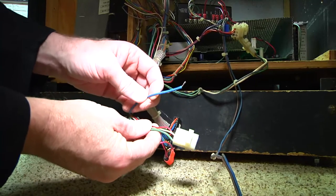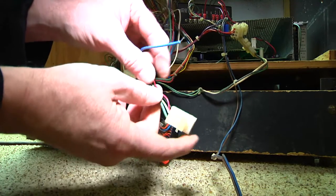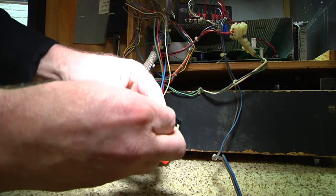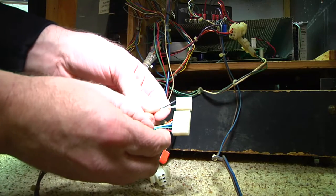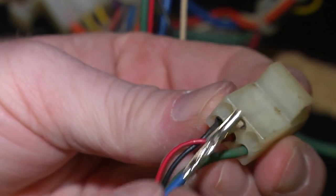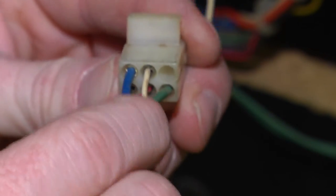As you can see, we got one of the blue wires that sends the signal into the monitor out from the motherboard. One of the female connectors broke off. So we are going to have to pop this out and see if we can get this corrected so that we can hook it up into the adapter. This adapter right here will hook into the Wells Gardner 4900. We have done the proper crimp as you can see — we crimped this wire off camera. And now we are going to put this female lead into the appropriate section on this connector, just kind of push it in. We were able to get the blue wire in its proper spot.